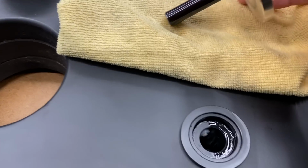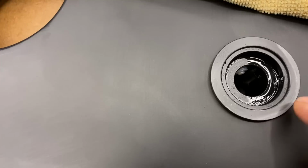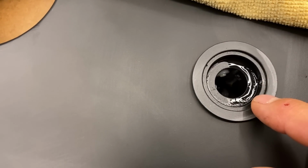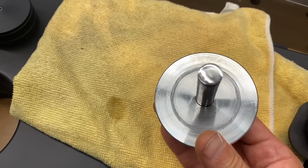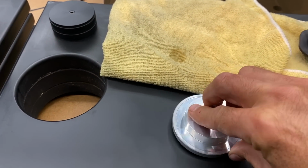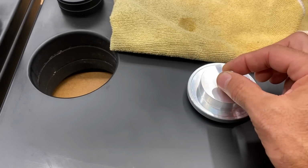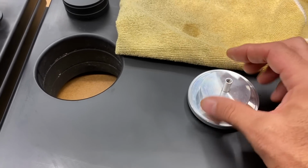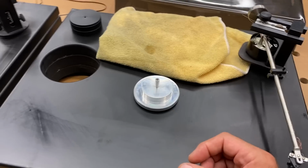So I think there's a total of 5 bearings, 2 right about here and here, 2 much further down on the opposite side but much lower, and then a third Teflon bearing for the upward force, which sits on this stainless shaft. So there's another Teflon bearing essentially holding this thing upward. Because of that sort of asymmetrical alignment of these Teflon surfaces, the bearing will seem to be really wobbly until you attach the elastic belt to the bearing system.